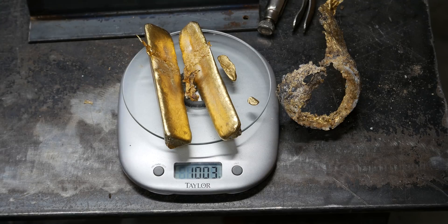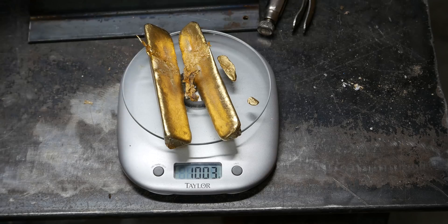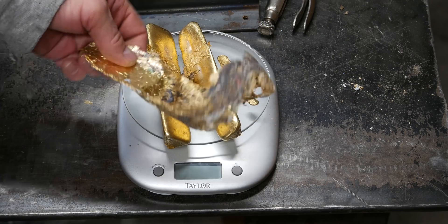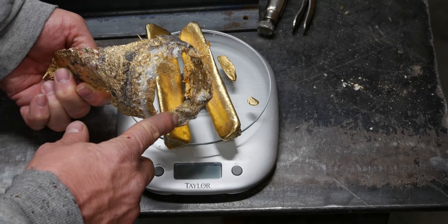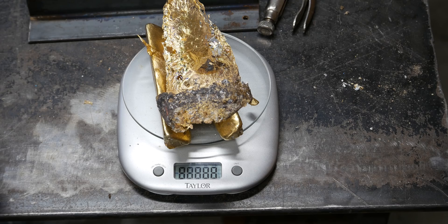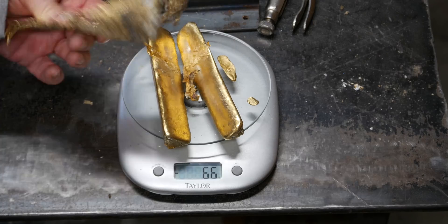Interesting — I started off with about 1,288 grams of material and I'm right at 1 kilogram now. This is what I pulled out of the crucible. There's no question there's dross and junk down in the bottom, but this all looks pretty good. I'd add that in and I bet it gets me pretty close to where I started. Aluminum bronze — I did it. I'm pretty excited.